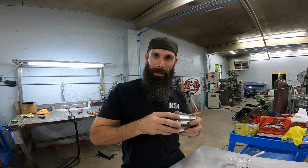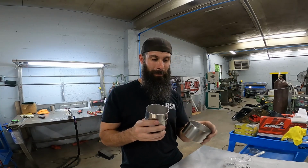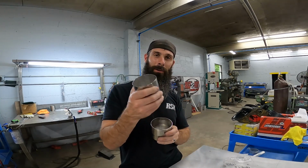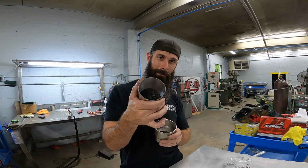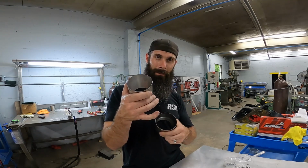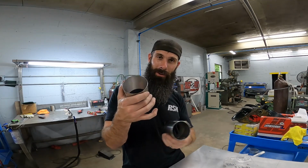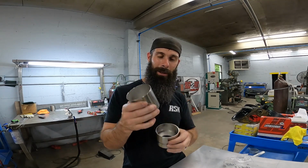Nothing different than a double slip header collector. Everything works the same way. So again, when it comes to assembly, your small collar or your small stub goes on the uphill, upstream side. Your bigger one that's swedged out goes on the downstream side. Obviously the small side faces the exhaust, because if you buy 3-inch, this will be 3-inch, and this isn't going to go on 3 inches, too big.